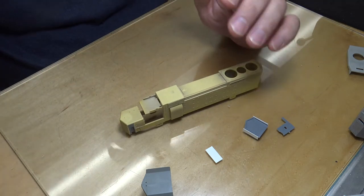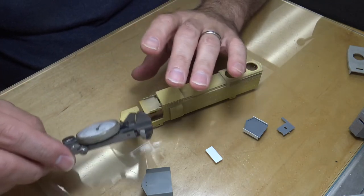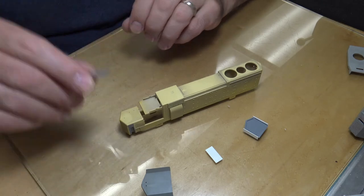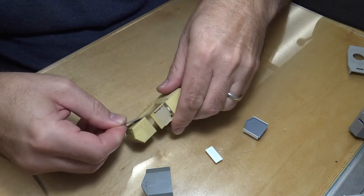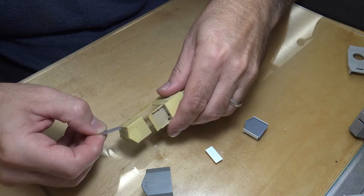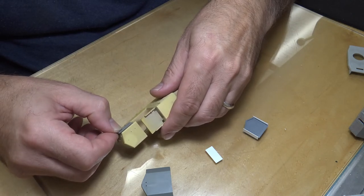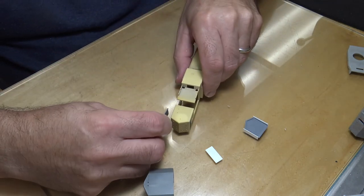Now I was thinking what I could do is I could use my calipers and I could line it up and scribe a line in and do that, but then I came up with another idea that probably would work better. So I have spare Cannon parts, so this is a part that's actually on this side, and it locates where those holes are supposed to be. And looking at this, the Kato holes are too low compared to where Cannon put his holes at. So I'm going to use the Cannon part, and if I just take it from this side